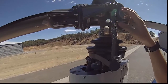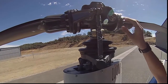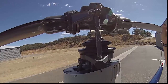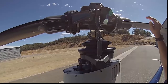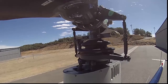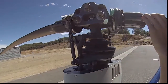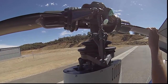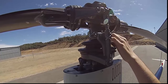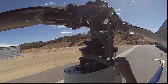Once you've checked the coning hinges, feather bearing, and flapping hinge on this side, go ahead and spin the blades around. Grab either the trailing edge or the leading edge and use steady pressure to push it around, then reach around and pull it the rest of the way. On the other side, check the feather bearings, all the nuts, coning hinges, cotter pins, torque striping, and flapping hinge — just make sure everything is the way it should be, the same as the first side.